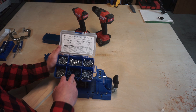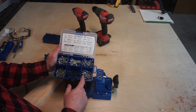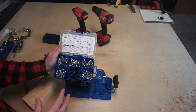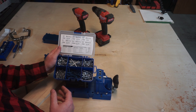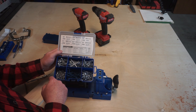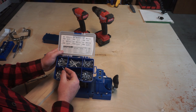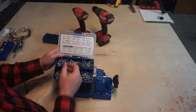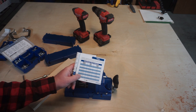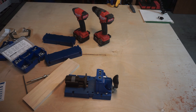The starter kit comes with 1½-inch screws, 2½-inch, 1¼-inch in different coarseness, and 1-inch. There are coarse and fine thread screws available for the Kreg jig. In general, you want to use the fine thread screws for hardwoods and the coarse thread screws for softwoods. This is a softwood, so we're going to be using a 1-inch coarse thread screw. Keep the chart from the manual because it tells you what screw length and setting to use for your specific material thickness.